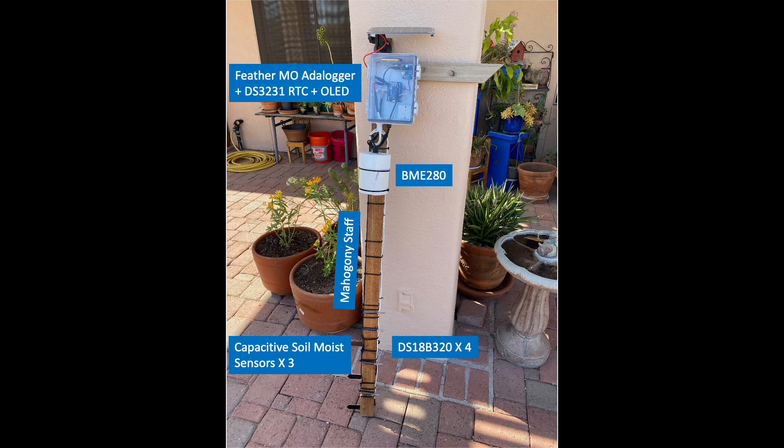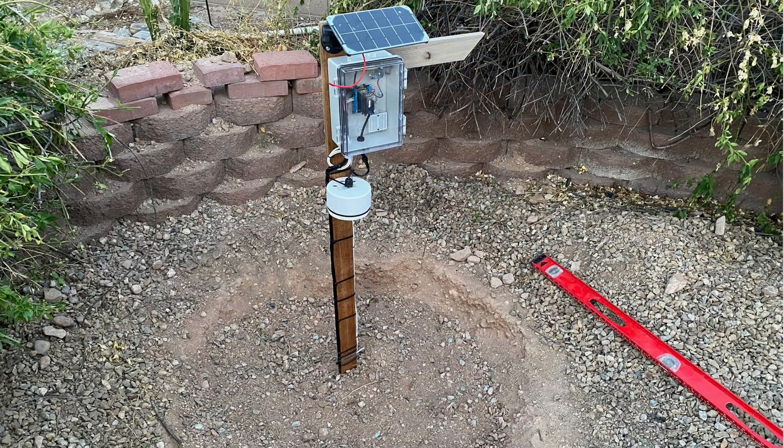The system is powered by a 2200 mAh battery that's topped off by a solar LiPo charger powered by a 6-volt, 3.5-watt solar panel, similar to the solar installations I've successfully deployed in the past. And here's the instrument installed in a new basin developed for long-term monitoring in my backyard.